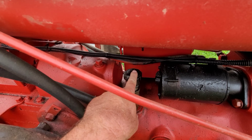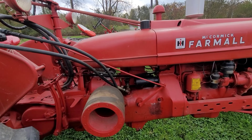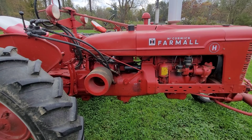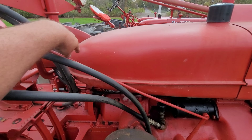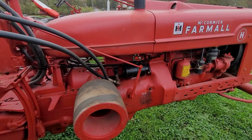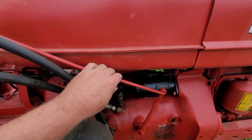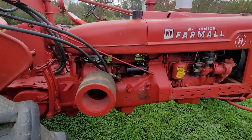There is a little hole in the top of this — that's like a pressure relief. My recommendation before we go into the plumbing: this is a planting tractor, so I pull the 510 grain drill and it has a cylinder. Do not keep the valve activated and held back continuously, because what that does is allow pressure to build up. That hole doesn't look like much, but there's a video from way back of me planting with this and popping the top.